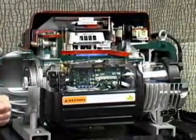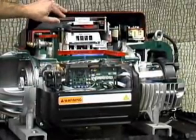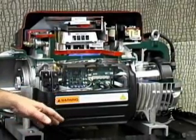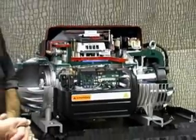This is called a smart compressor. It has integrated controls, both soft start, VFD control, communication, and safety modules. The safety module protects the compressor. The communication module interfaces with your building management system.